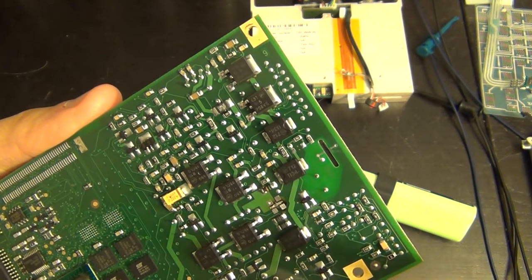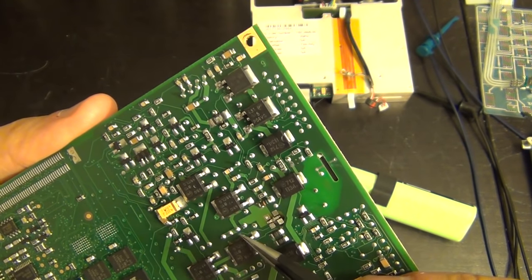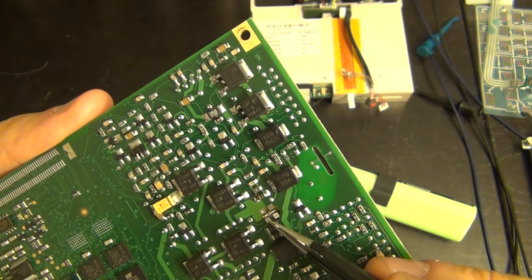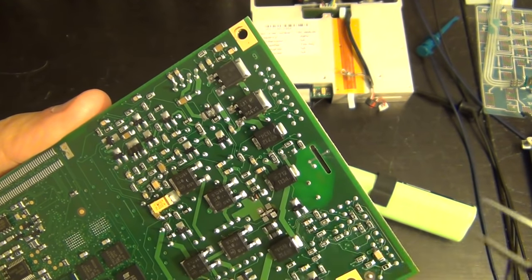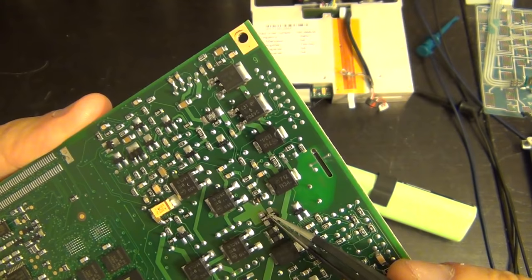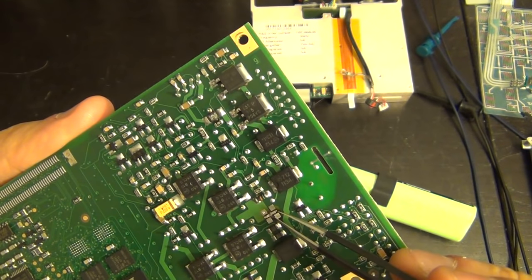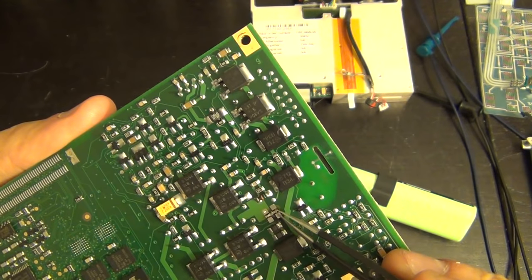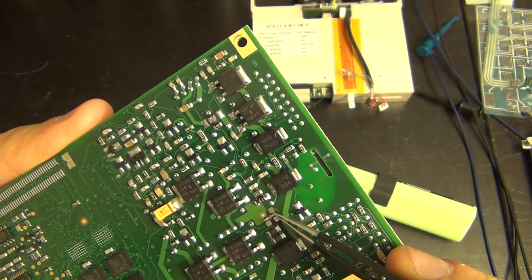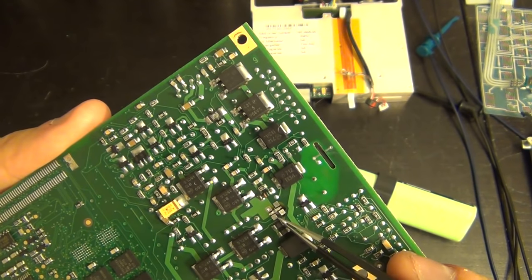At the time when you initially power it on, I'm assuming the gate was at V_DD to start current in the transformer, and then it would begin to do PWM. A couple of possibilities: the circuitry controlling the PWM is broken and the transistor is just fully turned on, drawing too much current directly through the transformer coil. Or the transistor I installed, rated for only 1 amp, simply wasn't powerful enough to run the DC-DC converter and it just died - unrelated to the system failure.